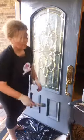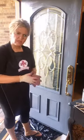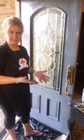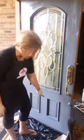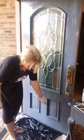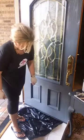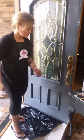On the door, if they have some sun damage, should they sand there first? If you have cracking and splitting and so on, I assume that's what they're asking. If you do, and it's rippling the finish of the door, it's always good to sand that off. No paint's going to camouflage damage, basically. Sand it smooth, paint right over it, and you should be good to go. So I had some here. You can see these cracks. This was latex where it kind of split from the sun hitting it over and over until it kind of marred the finish there. But this should seal it up and be good for the long haul. So again, I've used my little plastic bags here as my drop cloth.